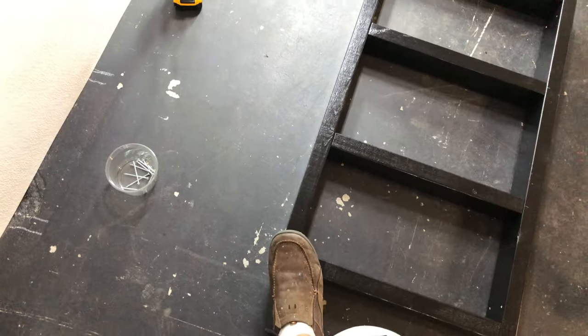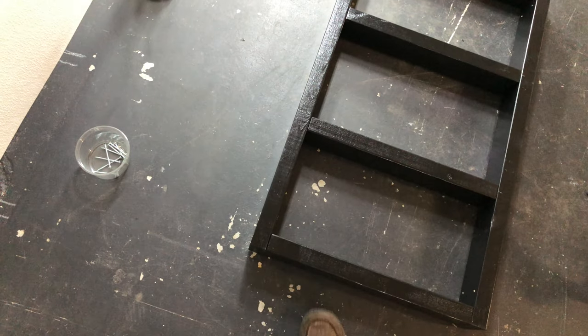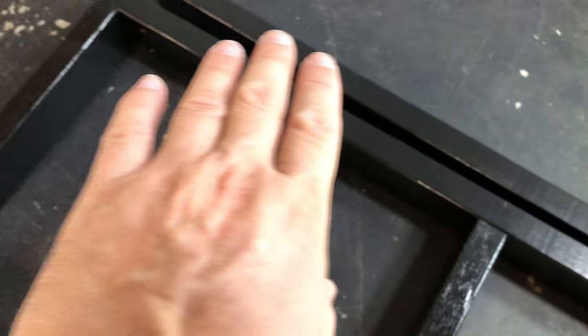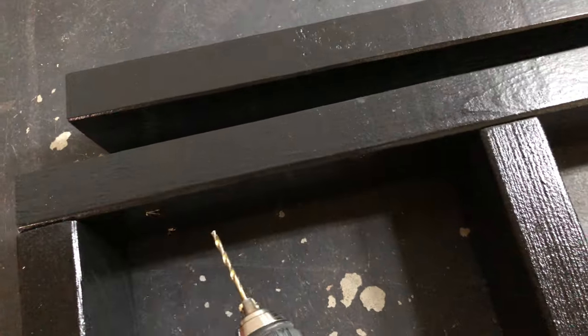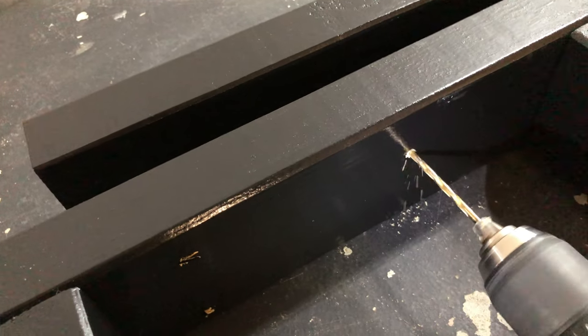Get the area cleaned up a little bit and get the burrs off the front. This is a little wobbly because of what was going on, but the main important part is that this is all flush at the top. Going to get two of these — as I go in I'm going to screw them flush to the top part. Put the pilot hole in here, and since I've got these I'll use one and hit it here, here, and here to get a nice tight fit. I'll use the machine screws and only go halfway through.